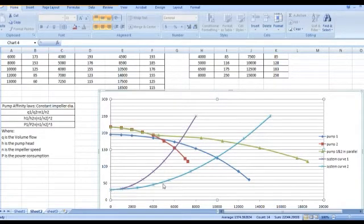However, if you want to run pump number two alone with this system curve, that could not be done — otherwise pump number two will burn out. Pump number one could be run alone with this system curve because there is an intersection with the system curve and the point is far enough from the end of the curve. But pump number two could not be run alone in this case. So we know we can run two different pumps in parallel, but first we must draw our system curve and check how each pump performs running alone or together.